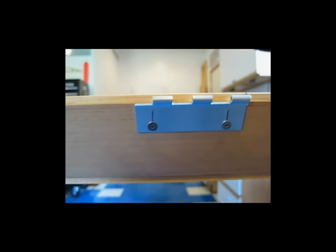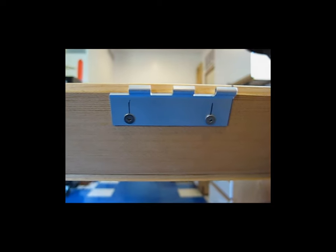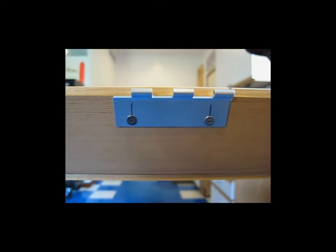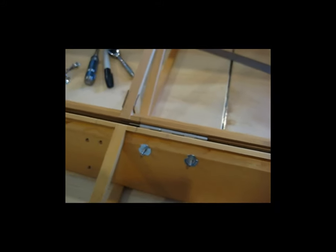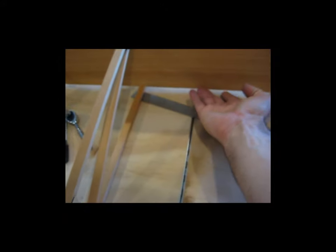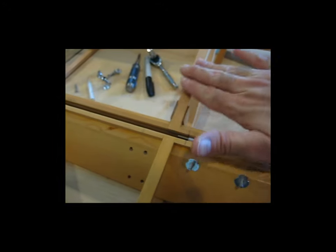This aileron is now ready to be taken over and fitted up with the wing, and I'll mark up the hinge locations on the wing itself. I've got the wing on a wood bench and the aileron on the same wood bench. The wing is laying directly on the bench with nothing underneath it, and the aileron is directly on the wood as well. That puts the aileron and the wing on the same plane, which is what you want.